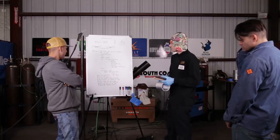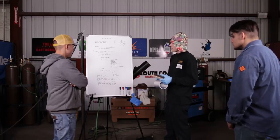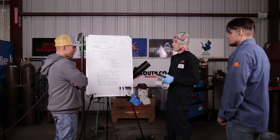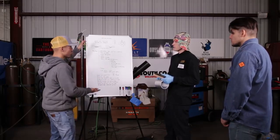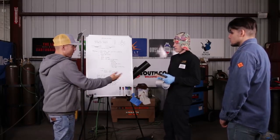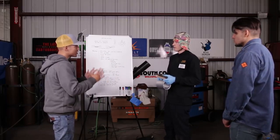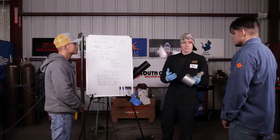Okay, sweet. So now, when it comes to aluminum, the settings on the machine, are you running AC or DC? Let these people know, especially because, like I said, it's an introduction to aluminum. Even though we're doing open root type, we're using a Miller Dynasty 350. What's a recommended machine for aluminum? Essentially, as long as you have a machine that is AC capable, with the negative for the welding characteristics and the positive for the cleaning action,